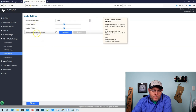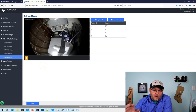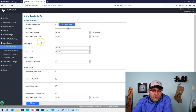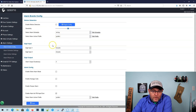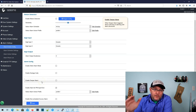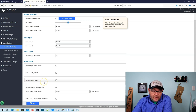We can change the doorbell volume and do custom ringtones. We can also do privacy masks inside of the video. So if you've got regions where you can't have the camera on — maybe for some reason there's a restroom door where you've got to do a privacy mask — you can configure that here. Here's all of our different alarm options. Here's enable motion detection, and then we can configure the region. We can select alarm schedules. It's got two digital inputs, a digital output, a silent alarm mode, a hostage code mode, and a tamper alarm. It uses magnets to know whether the device is being tampered with, just like other cameras, and it can do certain things if it thinks it's being tampered with.